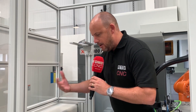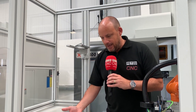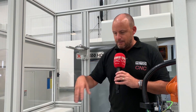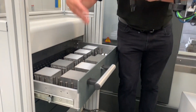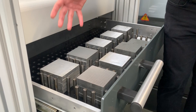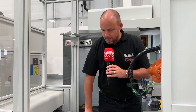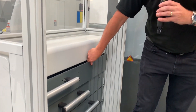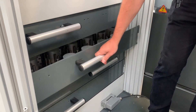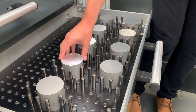What's interesting is it picks up the billet, puts it in the machine, takes it out of the machine, puts it onto the turnover station, turns it over, then back into the machine to do the second operation. In terms of setting, you're just programming the size of the part and it will tell you where to move these pins around on this grid plate. Wherever you move the pins, that's where you'll put your billets. The robot opens and closes the drawer, picks the billet up, and if you wanted round parts, you just change the positions of the pins and it will accommodate the round components.